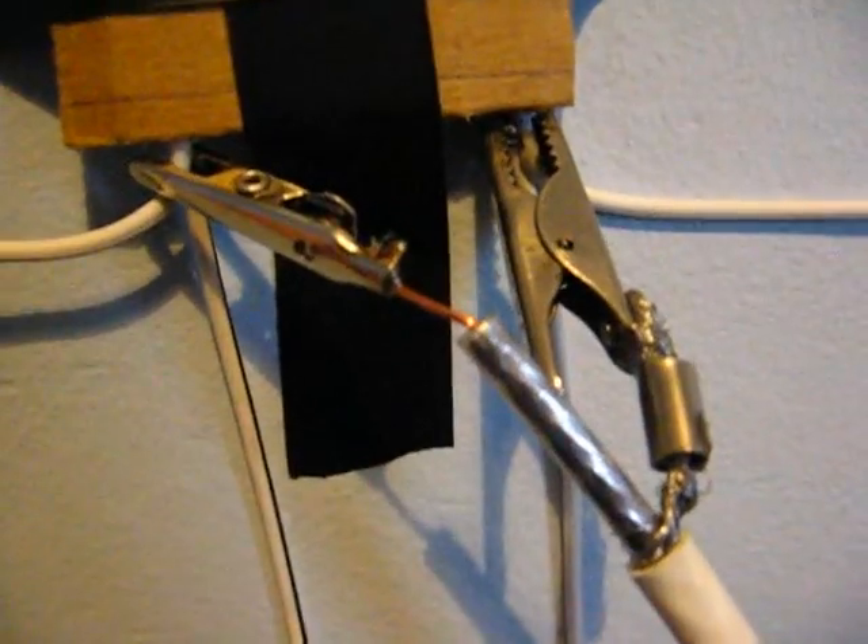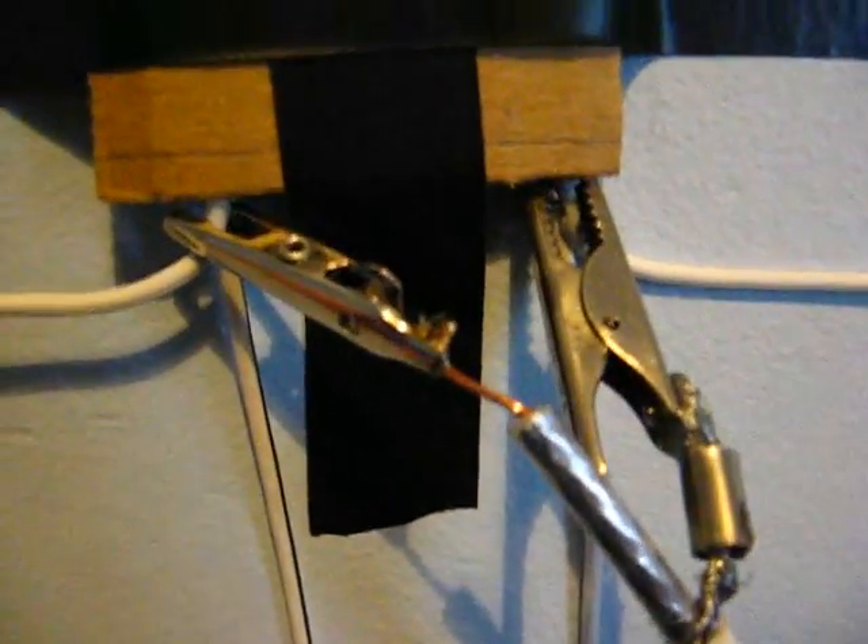There are the top two wires. I've come upstairs and taped it on the wall. A quarter-wave length of 75-ohm coax I've tried at the bottom wire — there's the matching stub. I've joined them together at the bottom. You can adjust that, move the short up for best SWR. At the moment this quarter-wave stub is working well.